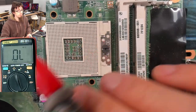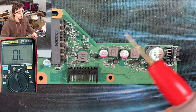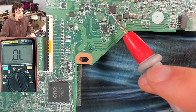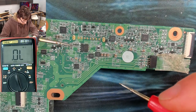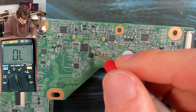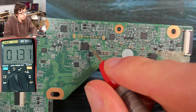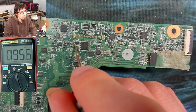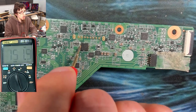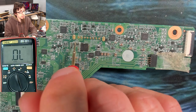The power probably goes up to areas where CPU power is happening. This guy here is to do with the battery power and charge circuit. Does our short circuit exist here? It does — we're down to about 1.3 ohms. What about the other side of that MOSFET? We're up into the thousands of ohms — so this MOSFET is off, cutting off power. Our short circuit doesn't pass through here to the battery. Nothing going on there.